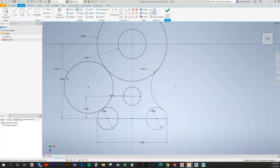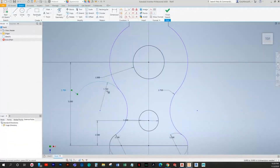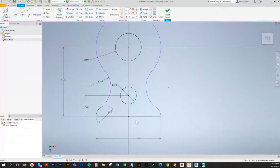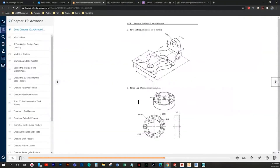We can trim — trim out this, this, and this. After that we can tidy things up. I'm going to try to reduce the amount of dimensions by setting these arcs equal to their counterparts. I had the wrong size on this one as it turns out — it should be 1.5 as a radius. Overall length is 9.